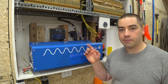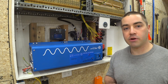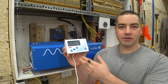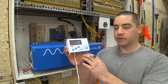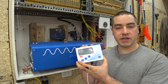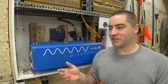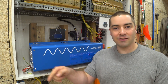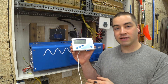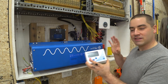We also need a way to measure all the electricity coming out of the inverter on the 240-volt AC side. I'm going to use this device called a TED, or The Energy Detective — a very old model, but the one I own. There are two associated clamps on the electrical wires inside the main electrical box, clamped on the generator leads, which is the port I'll be running the inverter into. We'll watch both meters side by side to capture all the electricity coming out.